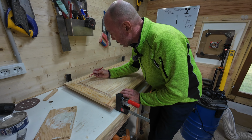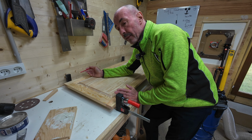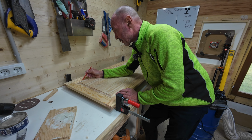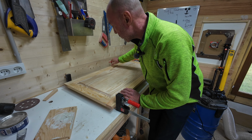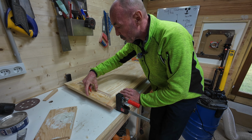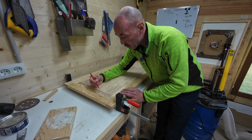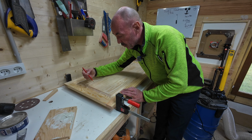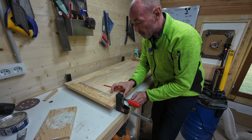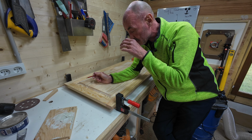But when I glued these up, I assumed, I think at first, when I glued the first three panels up, that the panels would be wide enough. Subsequently found they weren't wide enough, so I added a bit of offcut. The frame came out of the same piece of parquet floor. Basically, one of the offcuts that was left was big enough, so I just glued that on. What I should have done was add my joints sort of there, there, and there, which would have given me a much wider band around the corner to machine. So that's the mistake I made.